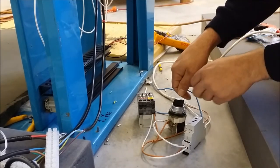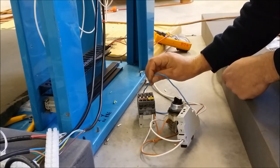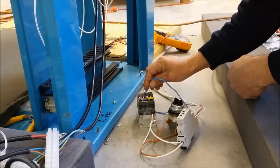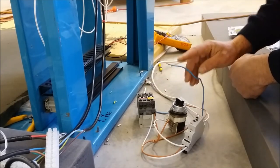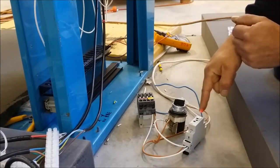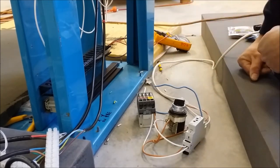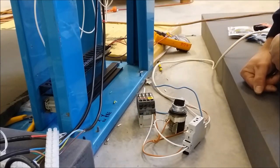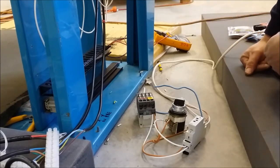So we'll do it again, turn the power on, and at the same time as doing that, this sense wire would automatically connect. But I've only got one set of contacts on that switch there. When we turn the unit off, this sense wire comes off. The unit's switched off, but power's still going to the timer. As soon as that kicks over, after half an hour, the contact comes off. So that'll enable the fans to cool the pumps down and the fans in the actual unit itself to extract all the hot air.